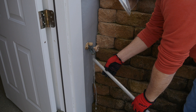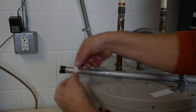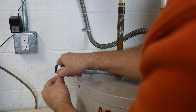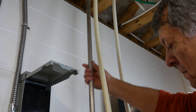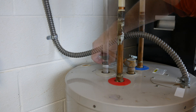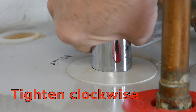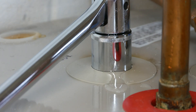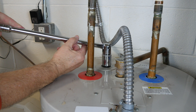You'll want to clean the rod with soap and water afterwards. Apply two to three rounds of Teflon plumber's thread tape, and the anode rod is gently lowered into place. If the rod is extremely difficult to thread by hand, back off and start again. The cheater pipe is not used here — only the breaker bar is used for tightening, and I tighten until the rod is snug.